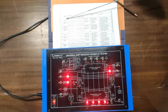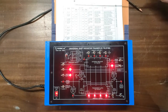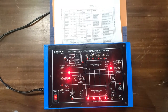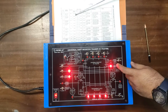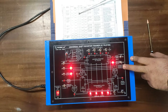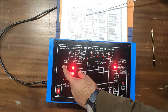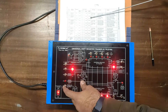Now we move to the second operation: Serial Left In, Serial Right Out — FIFO. We will input 1-0-1-1. First disable the master reset to clear any stored data. S0 should be at zero and S1 at one. Disable the serial output for the input phase; parallel output is already disabled.